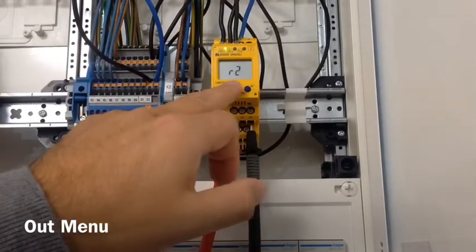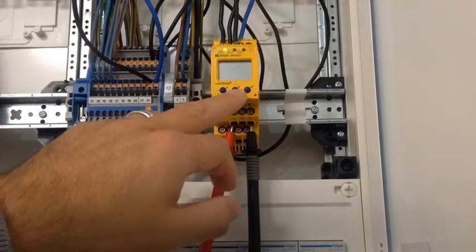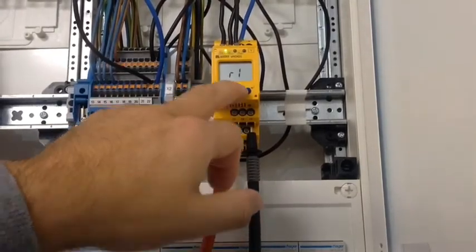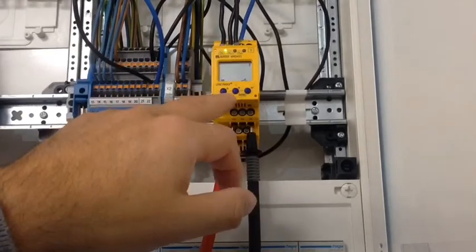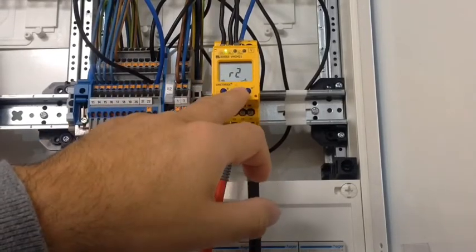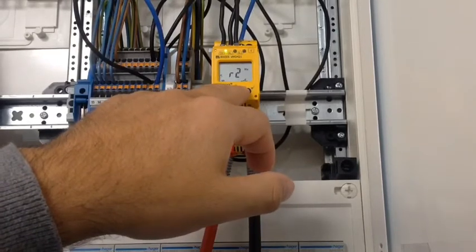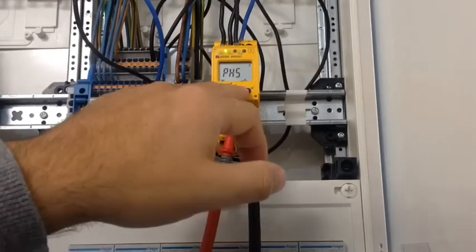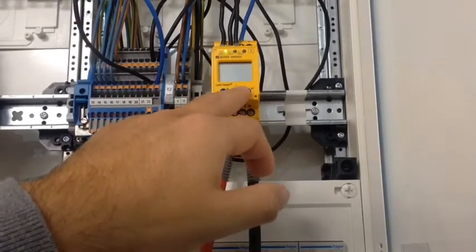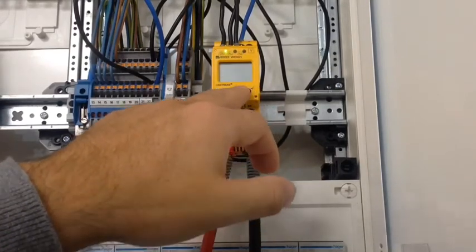We would do the same with R2. Looking at R2, we check that we have basically the same settings as R1: signal error is on, under voltage is on, over voltage is on, asymmetric is on, under-frequency is on, phase rotation is on, and the S-point AL is also on. Then we escape from the menu.